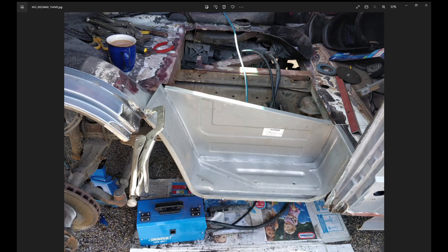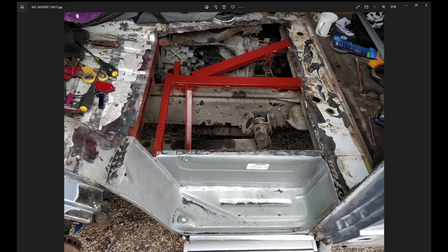I've also got to get rid of this slope - if I was putting the floor back to original it would be sloped at this angle, but we didn't want that so we'll cut that off. With a modified flat edge it's just a case of tin snips and bashing it flat. This frame on the inside here was already there pre-welded - it was a support for the fiberglass step. I've added a bit more to it; this strut goes down to the step. There's a framework underneath which you can't see and I've red oxided it for longevity - the mastic and fiberglass had actually protected it quite well.